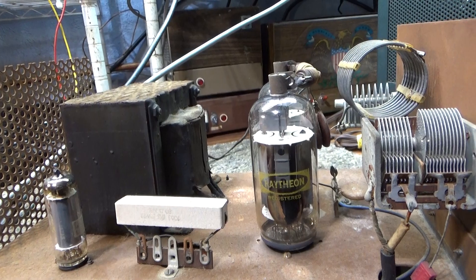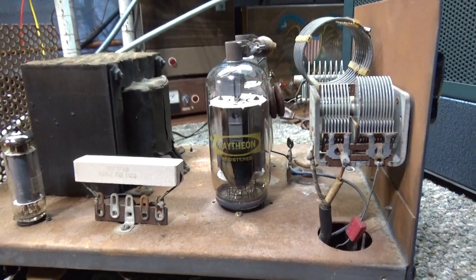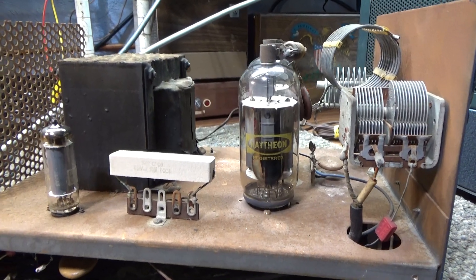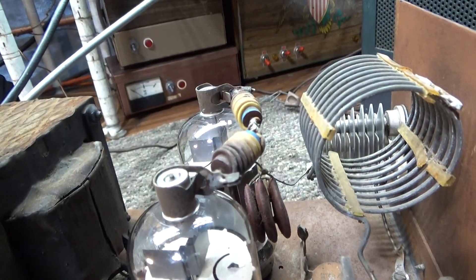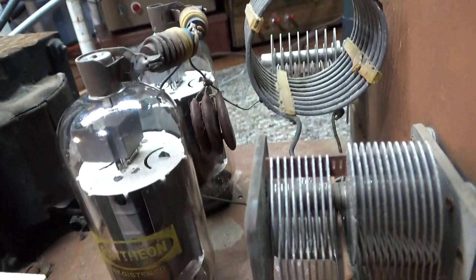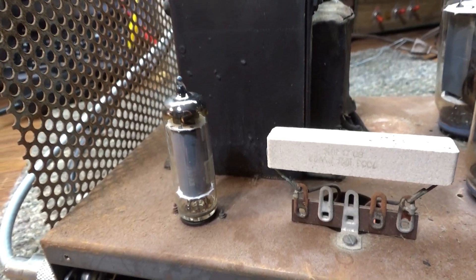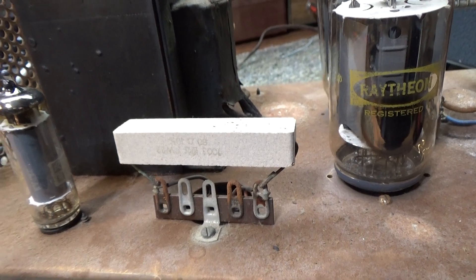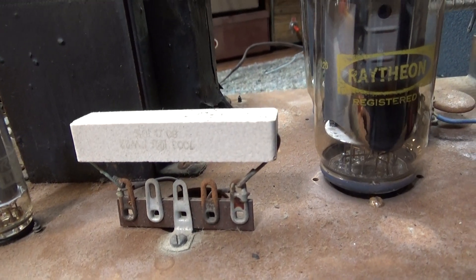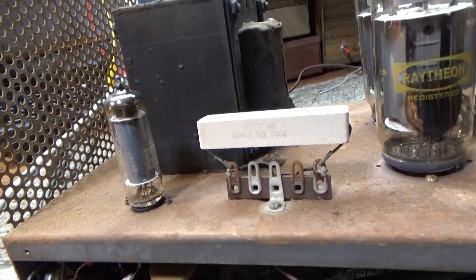I could find zero information on this amplifier, so I reverse engineered it and made a schematic before I dove in. Sure enough, the filament voltage is taken right off the mains. All three tubes are in series — the two 35-volt filament tubes are in series, that's 70 of your volts. Then there's a 6AQ5, so that's only 76 volts total. They use a dropping resistor to drop the rest. The AC starts at the filament of that tube, goes to that tube, goes to the dropping resistor, then through the 6AQ5 keying tube and back around. That's how they get filament out of this. I hate that — it's kind of dangerous.